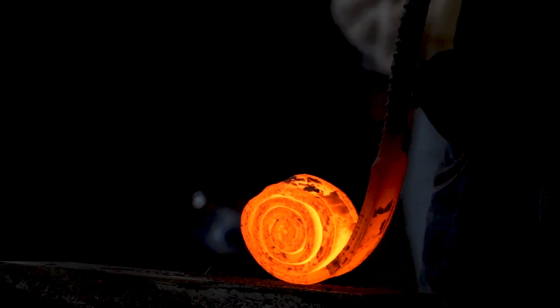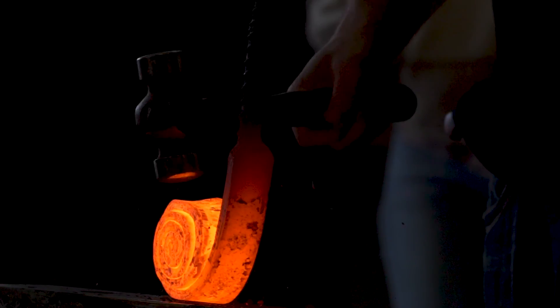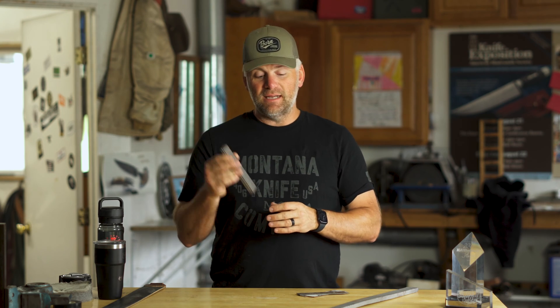The more you do that, the tighter your layer count gets. At that 600-layer mark it really starts getting tight — it gets like the grain of a tree at the end of the bar. It gets very difficult to actually see those layers because you literally have 625 layers in a tiny little space. So when you're making your own Damascus steel, a lot of times it's better to stay down in that 100, 200, or 300 layer count where you can actually see the layers — it's very visual for a customer to look at.